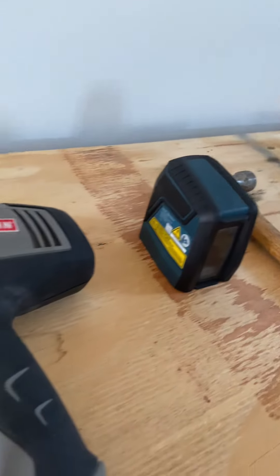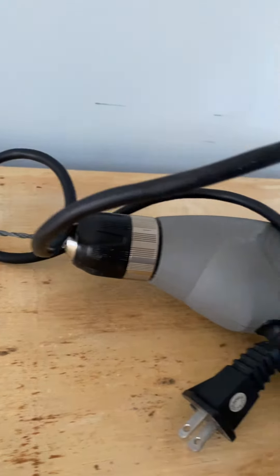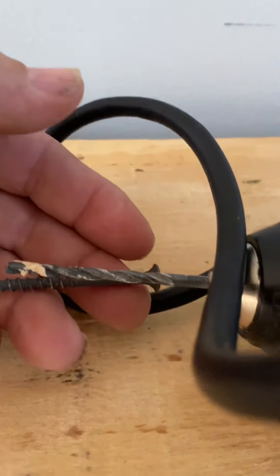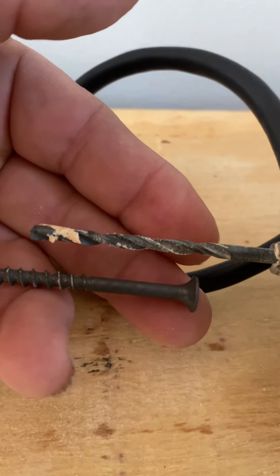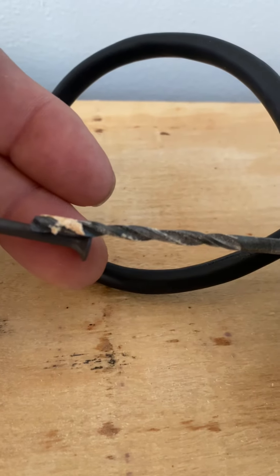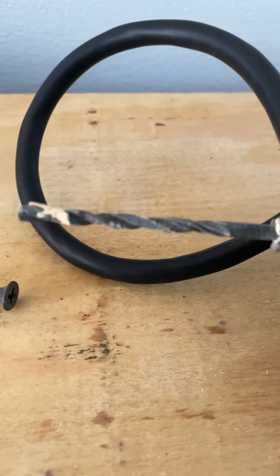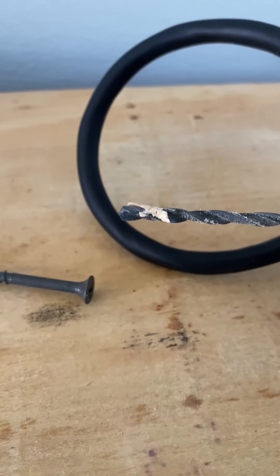The laser is so important. Then you got the pre-drill — you got to pre-drill every hole, and you got to take the thickness of the screw and match it like that. See, the screw's a little bit thicker, as you can see. So now your screws go in easier; you don't struggle.